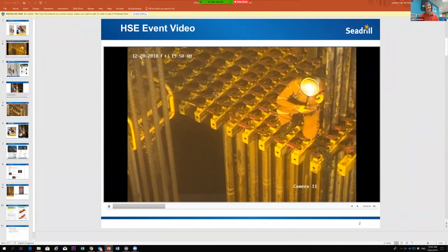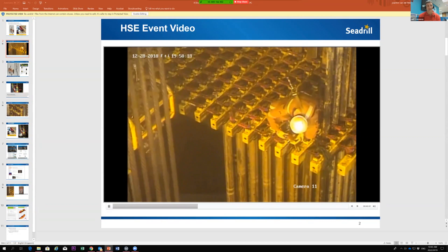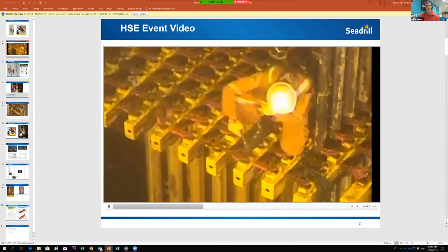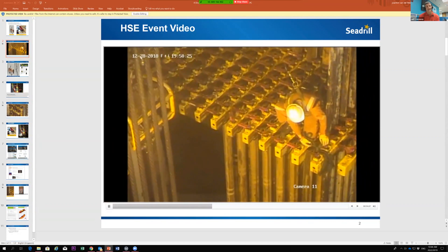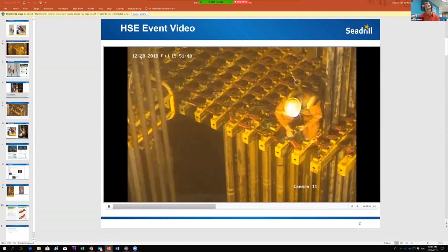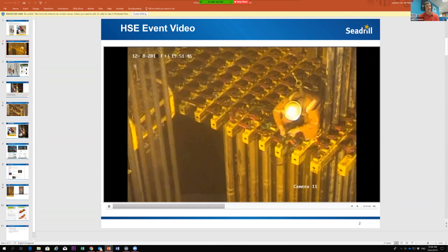You can see he's taking the bolts, using his coveralls, taking off his gloves — this is not bad practice, just how the mechanic was doing it. On this particular installation we've had a lot of issues with the fingers, so these guys are almost professionals at changing them out, it's such a routine task unfortunately. He zooms in, tries to put the spanner back in his pocket, and right then one of the spanners dropped to the drill floor. He then ties off the finger with manila rope so when he pulls it out it prevents it from dropping.